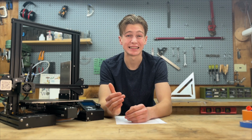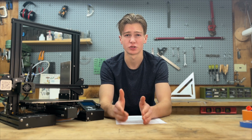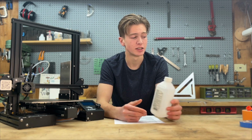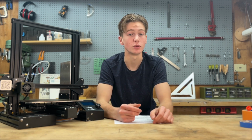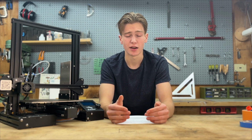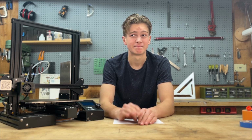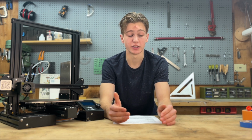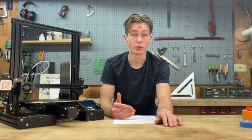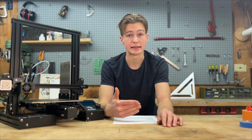When you're using materials like TPE and PETG, they tend to stick to the build plate much more strongly. So in that case, you might want to use some type of release mechanism. Different types of sprays and stuff that you can get to put on them. But that is a bit more complex, and most likely you're not going to have to start with that. I wouldn't really approach that until you've tried all these other things, because these other things, I would say, affect way more prints, can be fixed much faster, and for a lot of them, you don't need anything special to do it.